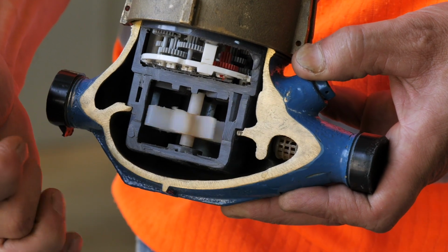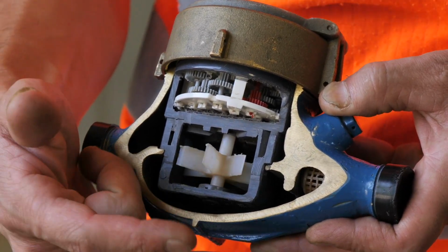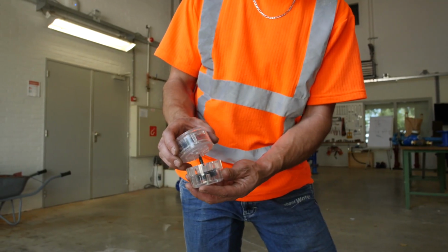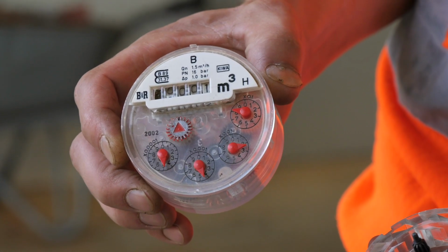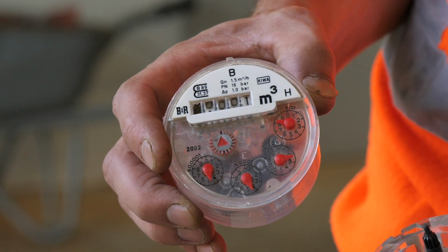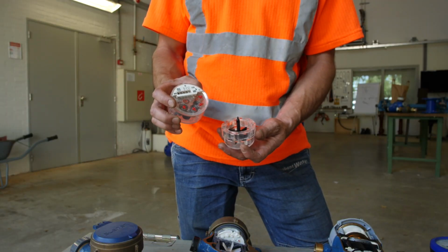There are several types of water meter. A mechanical single jet or multi-jet water meter measures the flow by means of an impeller connected to the readout unit located on top of the measuring chamber. This type of meter is sensitive to orientation, which is why it needs to be installed horizontally. Skewed installation will cause disbalance and subsequent wear and tear, resulting in incorrect flow registration.